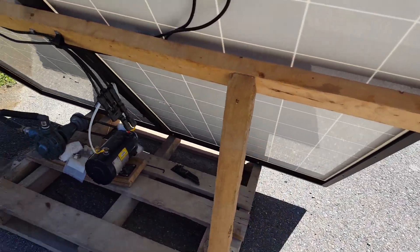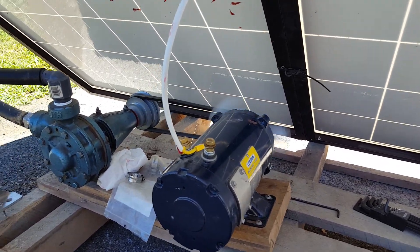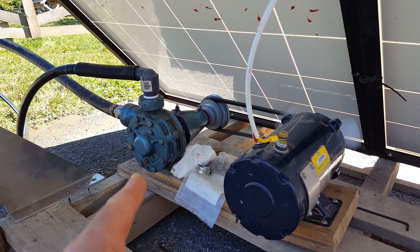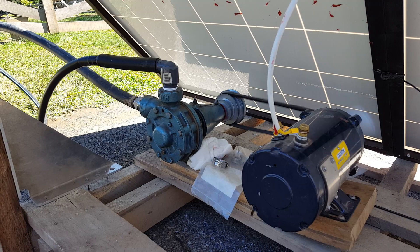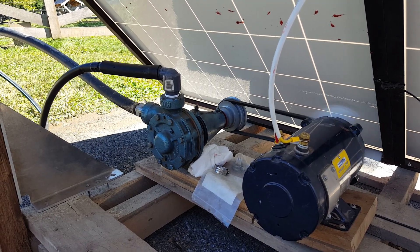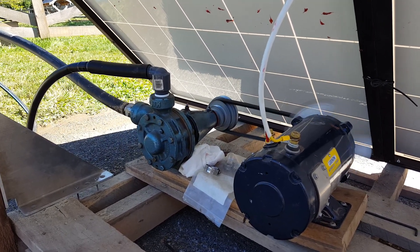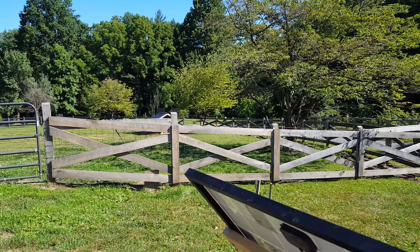I had a 27-volt half-horse DC motor that I got from a guy on Craigslist, and this great little circulating turbine pump — it's a Roth, and it's a regenerative turbine pump, which is kind of a hybrid between a pure centrifugal pump and a pure turbine pump. It's rated at about a quarter or half a horse — small pump, but it's good for high-head, low-flow applications. I have about 70 feet of head from down there at the creek, and I'm going to pump water all the way up to my rain tanks, which are empty right now.